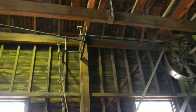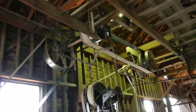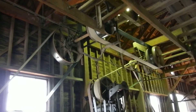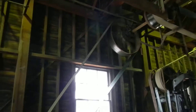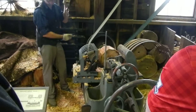The way we bring the power down to the machinery is by shifting a belt from one pulley to another. If you take a look at the pulleys up there, you'll notice there's one that the belt's running on at the moment — that's called an idle pulley, and it just spins up there. But as I pull down on this hook, you can see that belt get pushed across, and it keeps our drive pulley spinning — that's the one attached to the shaft that brings our power down.